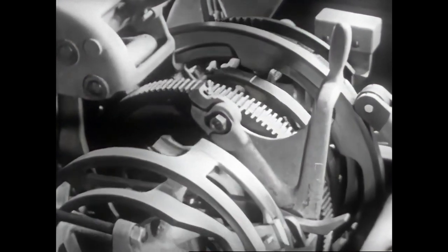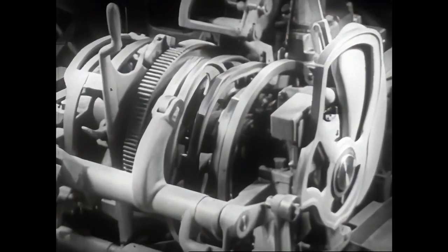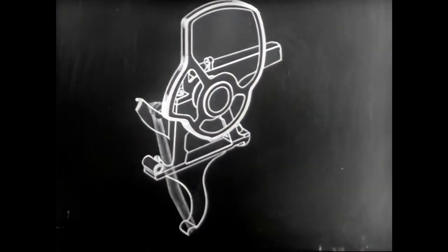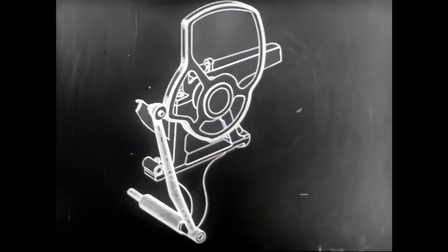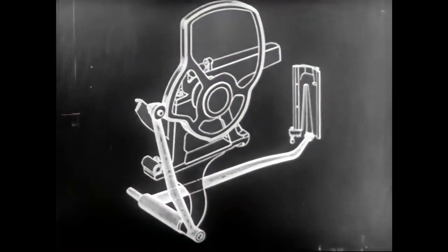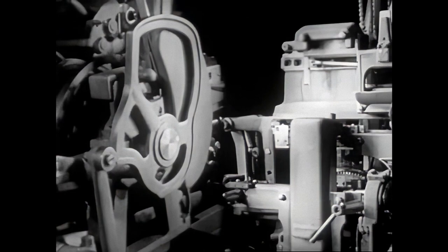Every eccentric cam has a specific function which it carries on during its cycle, quite independently of the others. To get an idea of how the cams work, let's observe the first of the series that controls the first elevator. The first cam, by means of the vertical lever on a pivotal mount, and the long horizontal lever, which runs through the base of the machine, transmits the movement of the first elevator. Every turn of the cam corresponds to a determined movement of the elevator, as we see in the close-up combination.